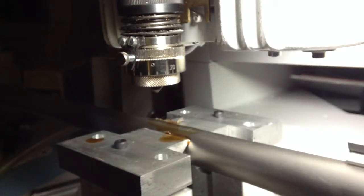The spindle is going about 12,000 RPM and we're going at 7 inches a minute. If you calculate that out, it comes out to just a little bit more than 1/2 of 1/1000ths of an inch travel per revolution. It seems to be a pretty good compromise for length of tool life and the evenness and nicety of the cut. We put some cutting oil on the barrel.